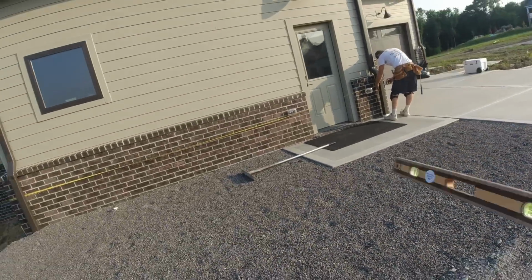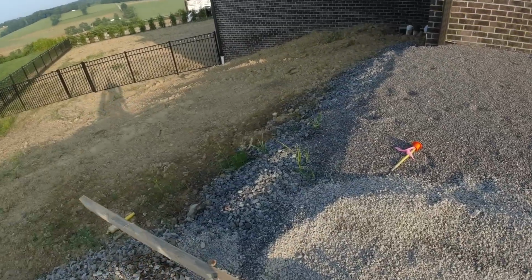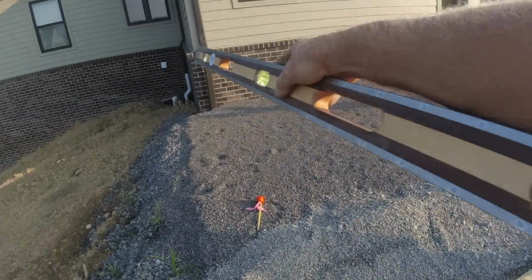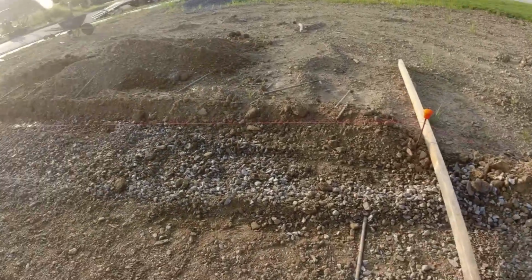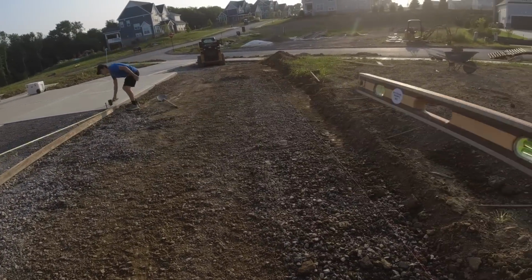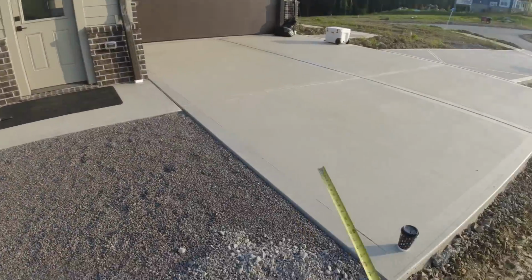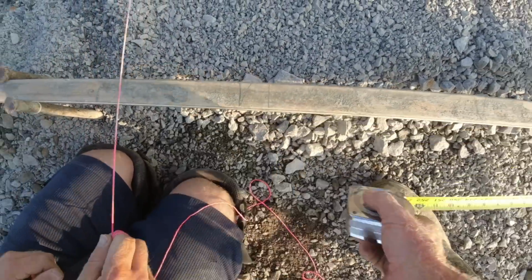So now Steve's measuring 20 foot 9. We'll find this corner. We'll pull a number. We'll pull a string and find a good corner here. Same plane as the driveway out, 12 feet, and make this all line up. I'll go ahead and put that together and I'll show you. Corner to corner, 21.9. Hook it on that. We pull over 21.9. And here we are right here.